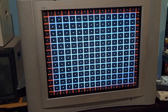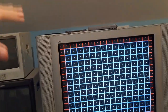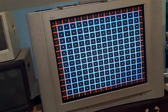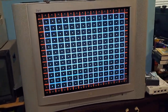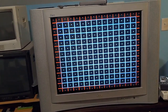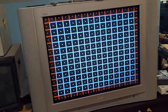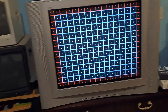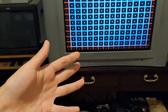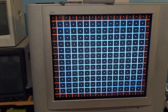They weren't convergence strips, but they were just little magnets that do help pull the corners a bit in a sense. I had to redo them all. I finally got them set right, and it took me about five or six tries. It also took a lot of glue because every time I had it set in place, I glued it down, then didn't like it, took it apart, and re-glued — it was just a mess. So overall I did convergence, geometry, purity, magnet adjustment, and focus. I also did a little focus adjustment just to make sure everything was good with this CRT.